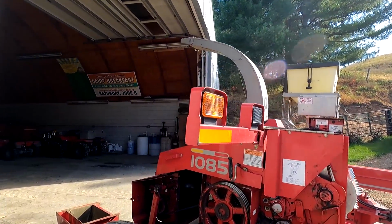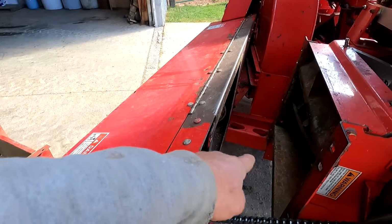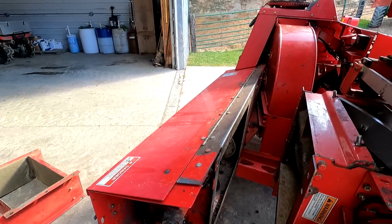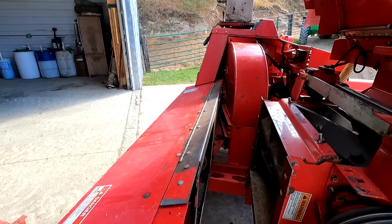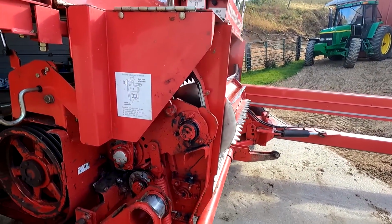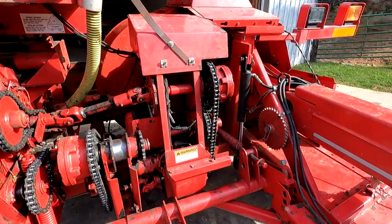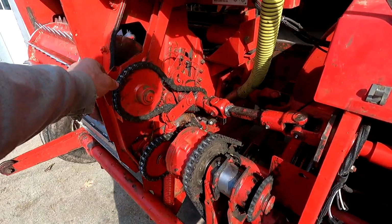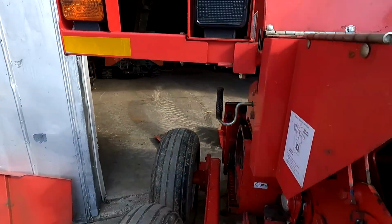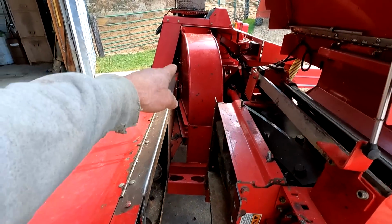What I got to do today now is I got to put that in this hole here. And there's various bolts to put in and get that all snugged up in there. Probably grease everything. And what I like to do is put grease in all the zerks after I washed it like that. So it kind of pushes the water out of everything. You know, there's water that gets in the bearings from all that pressure washing and stuff. I don't know, I usually don't oil the chains until spring, but I could. I mean, I dumped some waste oil down in the cutter head, the last thing I do. And maybe a little bit in the blower.